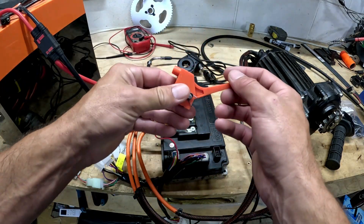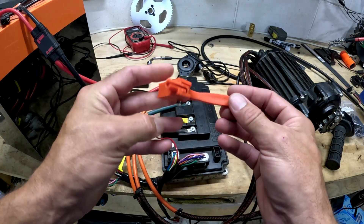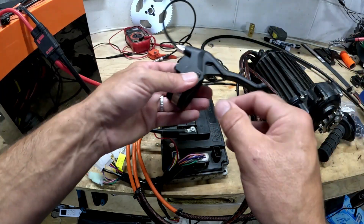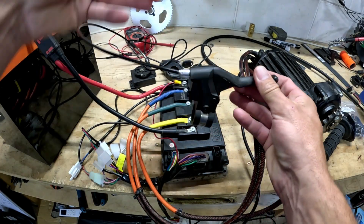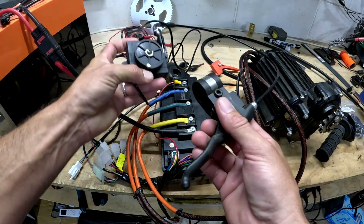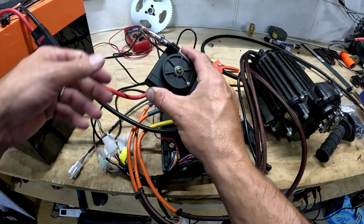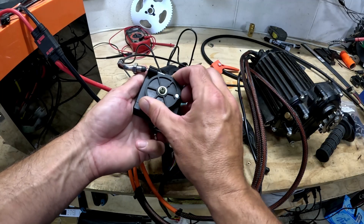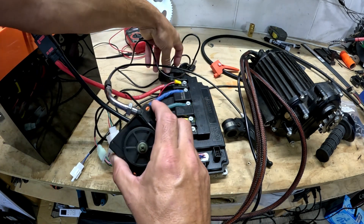This is how you were supposed to give your gas engine some gas, but this thing is rinky-dink and cheap. What I actually found was a Razor brake lever and I think that's going to work out a lot better — look at the difference in size. Then we're going to run that to one of these guys, which takes a manual cable connection and transforms it into an electrical connection, so that when this spins it's going to give your motor power.